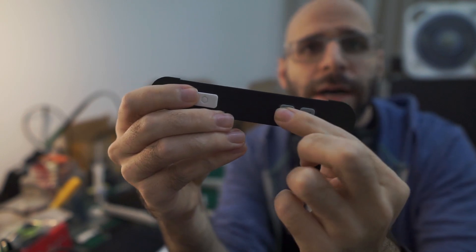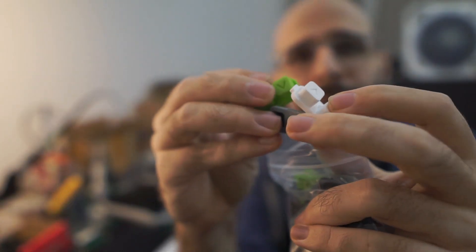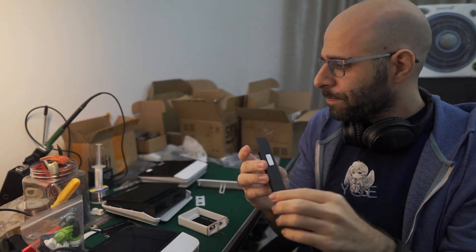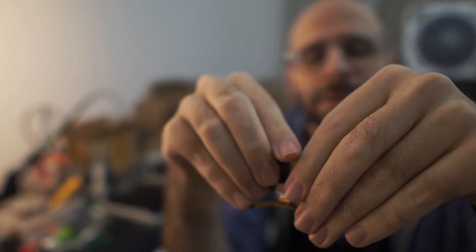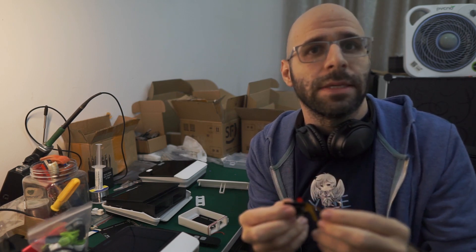The mechanical buttons feel quite good, and we just received some samples that are exactly the same as the final ones. They are compression-molded silicone — very nice and squishy. This is a good breakthrough because we can now test almost the final buttons. At the same time we've been testing OLEDs: we shortlisted three OLEDs, each with different wiring. We're still testing to find the best one. All three OLEDs are custom, and we're making sure we get the right brightness, performance, and reliability during assembly.